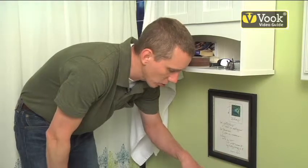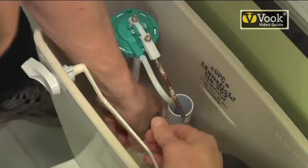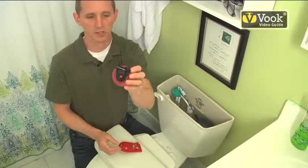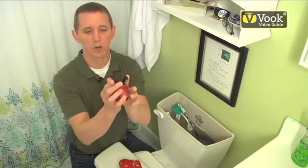What's going on is the flapper valve itself is simply not settling correctly on the hole in the bottom of the tank, which allows water to travel from the toilet tank into the toilet bowl. In that case, you need to simply replace the flapper valve.